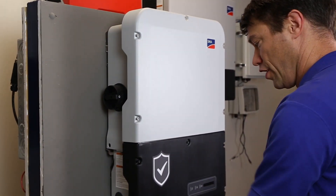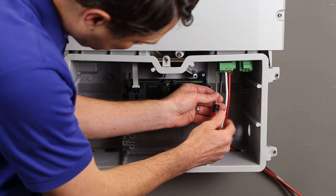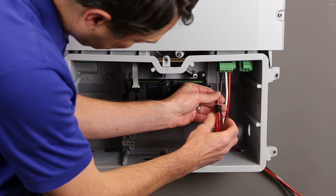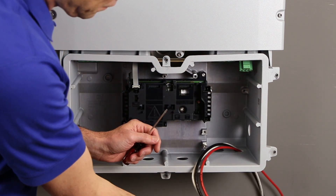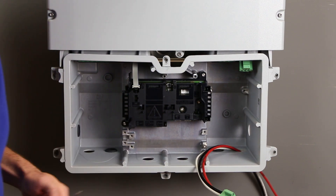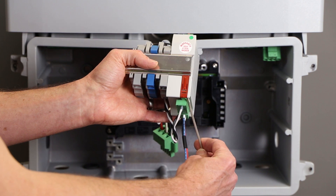Ensure that the LCD board ribbon cable is detached. The revenue-grade meter kit ships with the AC plug connector to the power unit upper part of the inverter. Remove the existing AC plug if needed by loosening the two screws on either side with a small standard screwdriver and remove the plug. To install the DIN rail, the meter must be taken off so that the screw holes are accessible.